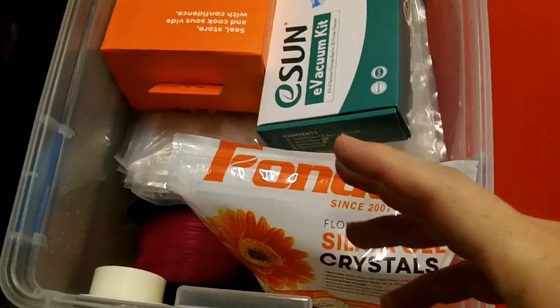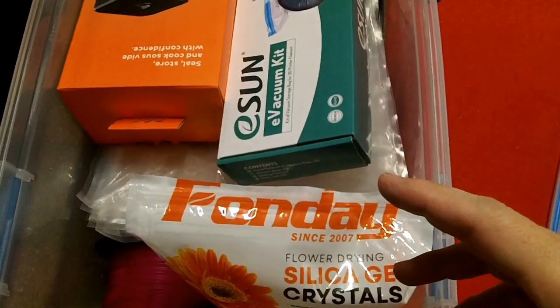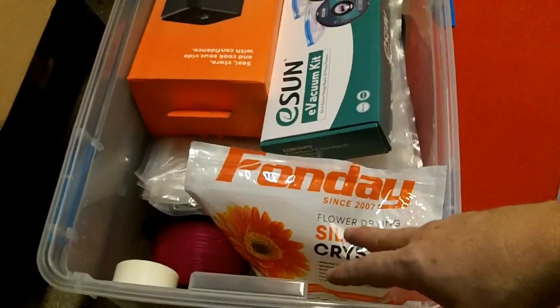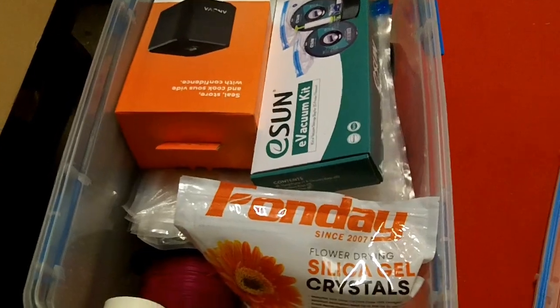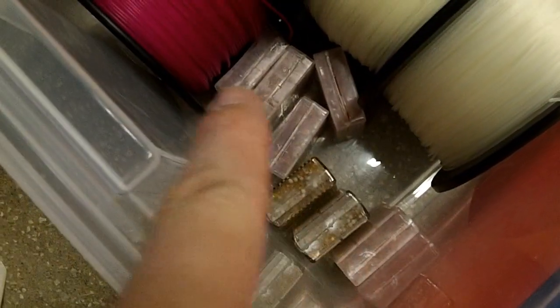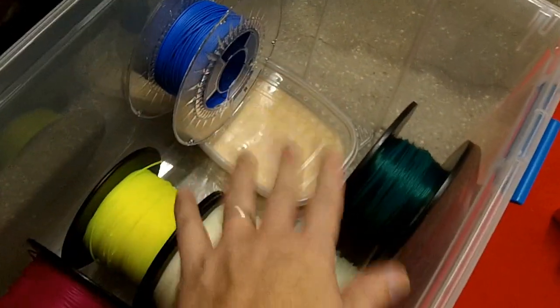We're going to open it up. That's going to expose everything to the 63% ambient humidity. I'm going to get some PLA out, and I will put a few things in, and then we'll close it back up. So the air inside will get the ambient humidity. The color indicators are still orange there, and they are still orange in all these guys. So it has absorbed water from the interior, but it hasn't been used up yet.